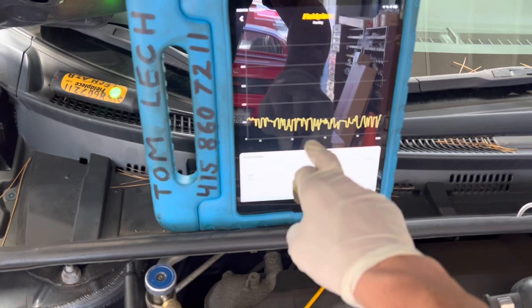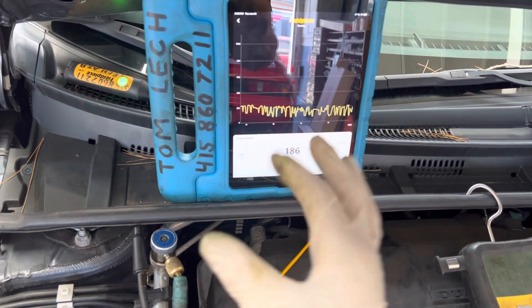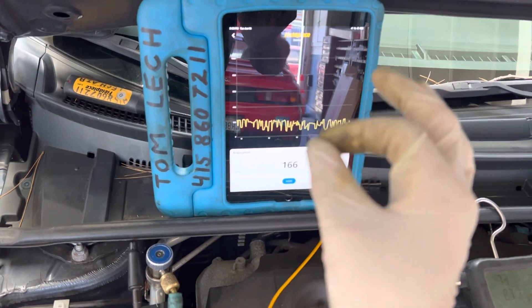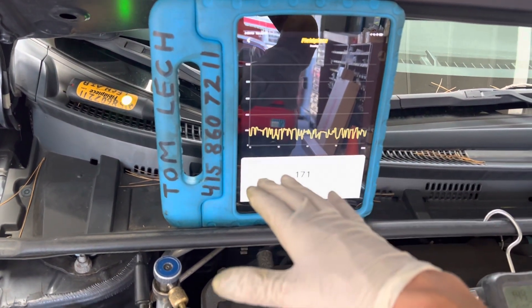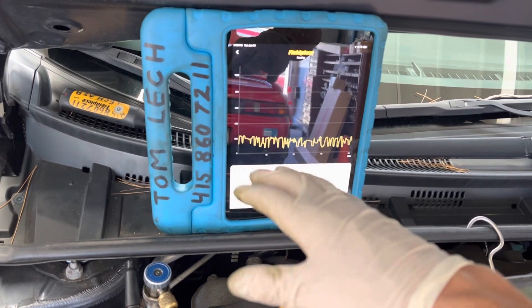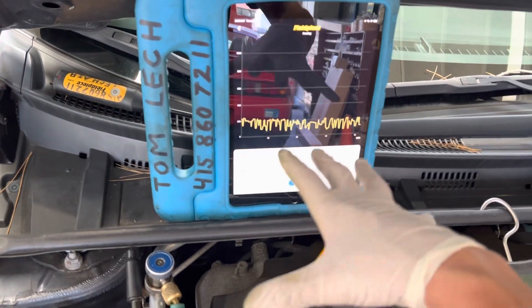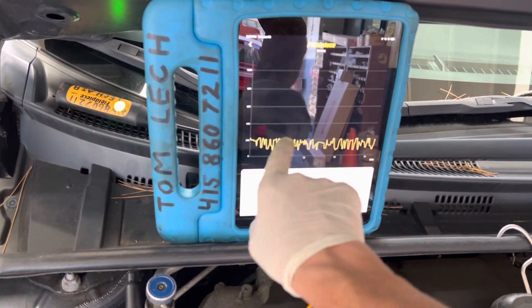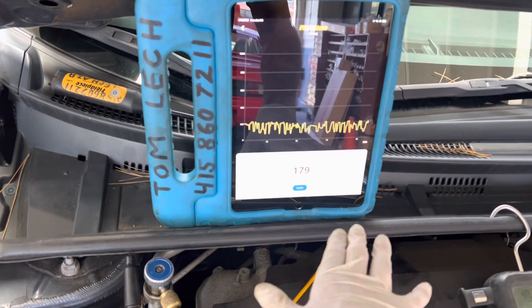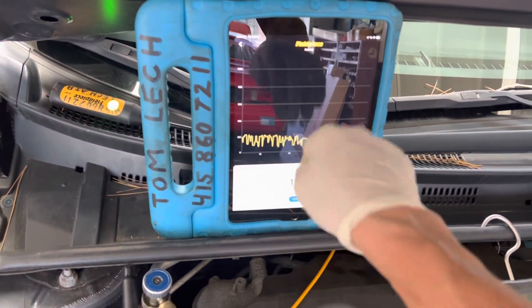You see how this goes up and down like that? What that is, is the vacuum from the vacuum pump is attempting to pull a very low vacuum. But the slight amount of moisture that is trapped in the pores of the metal, in the oil, a little bit of refrigerant from yesterday is bursting and bubbling out. So as the pressure goes down, it reaches a level where — like steam at 212 degrees — under vacuum, water boils and flashes off as steam at a much lower temperature, at ambient temperature. Every time it tries to go down and gets below that level, the moisture pops out as a little burst of steam, raising the pressure in the whole system. And that's what you're seeing — this up and down.